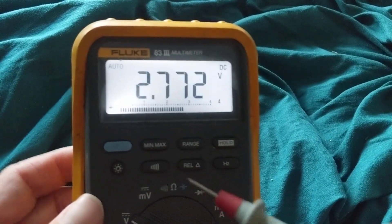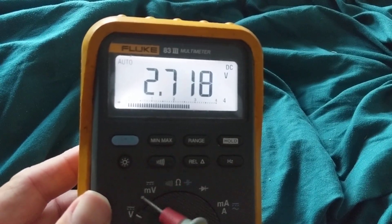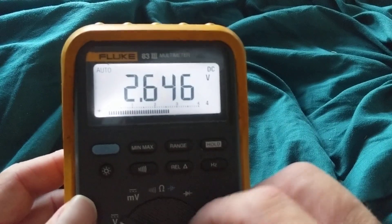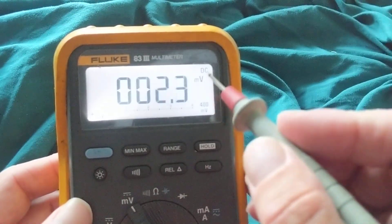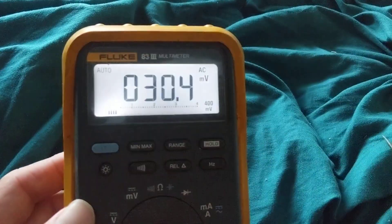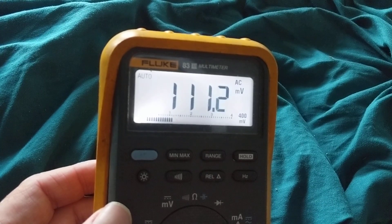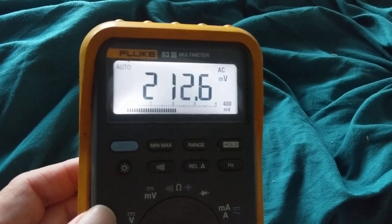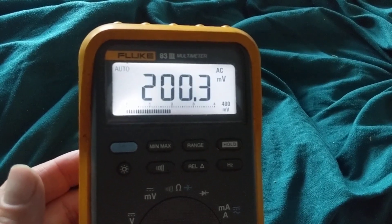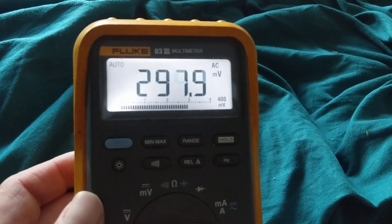Let's review: resistance — use the horseshoe ohms symbol. Continuity — use the audible setting. DC volts — you have two choices: millivolts or volts. I like this meter for beginners because it tells you exactly what mode it's on, like DC volts or AC millivolts — you can't make a mistake. Please go to my channel, Joe Electronics Schematics for Auto, for more videos. I'm working on hands-on projects and hope to get under the hood soon. Thanks for watching — please subscribe.